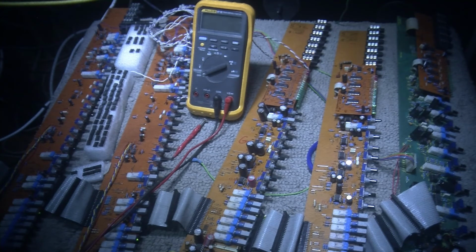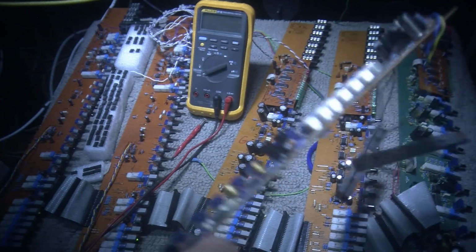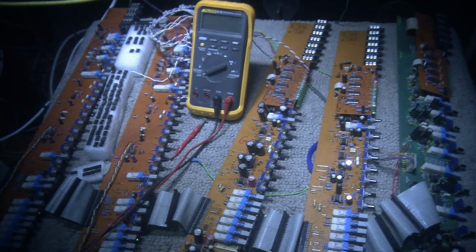So anyways, I feel good because I'm finally going around, and it was doing some horrible crackling at times, and it especially gets worse when there's a lot of moisture content in the air. I'm pretty sure I fixed most of the solder issues. There were some bad solder joints, so I'm pretty sure I got almost every solder joint. I literally go over it with a magnifying glass and a flashlight, checking continuity. And also you can tell the boards are super flexible. There's a danger if you flex the board too much. It's very thin and flexible, so you can see how the trace would easily crack on the back of that.